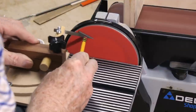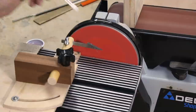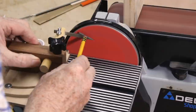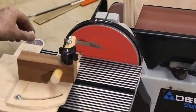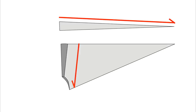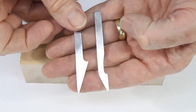If you let the steel become very hot — which may take only seconds — it will become less soft. I work hard to finish all the shaping and surface polishing while the steel is in its fully soft annealed state. Sand both sides until you've achieved smooth and symmetric bevels. Note that the blade tapers from its back edge to its cutting edge and also from its shank to its tip. After the power sanding is done, use hand sanding to refine the tip and the edge shape.